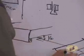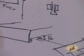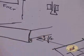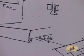And they solved the expansion and contraction problem by making quite a deep groove in the front of the drawer and not feeding it all the way. And then generally in early America, they would just use a light wire nail right there. And a wire nail's forgiving enough that if you did expand in really wet weather to where you bottomed out in the front groove, the nail would give a little. And also the back of the drawer would bow a little. So it was very forgiving.